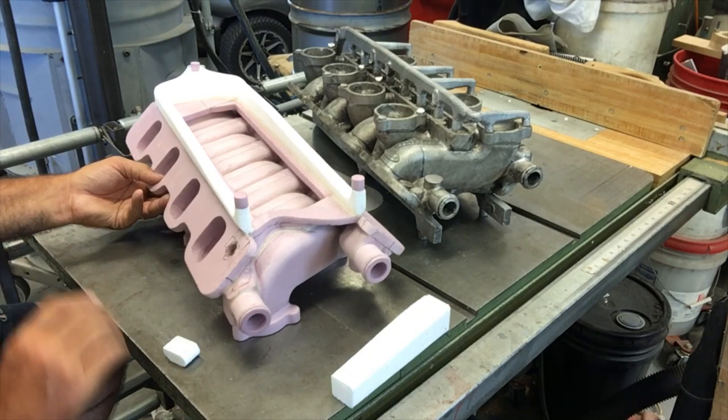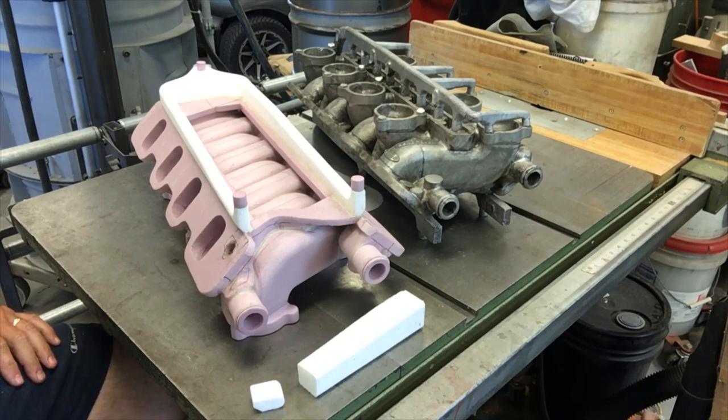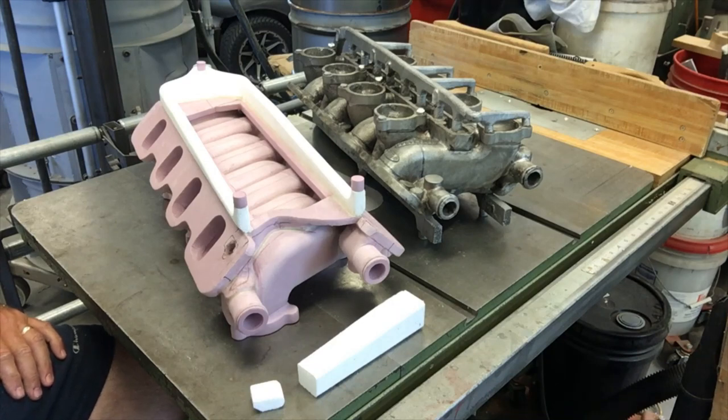And then I'll come back here with you, and when I pack it, made some changes too. I've got brand new sand. It's fresh sand. I noticed that my old sand, when I was sifting it, has probably become contaminated, but it just didn't flow and move under vibration as easily as fresh new sand did. So we're going to have new mold media. My old media was 5 years old, so it didn't owe me anything. So 35, 40 bucks later, I've got 500 pounds of fresh new sand, and a new position in the mold, and a slightly different packing method, which I'll elaborate on in the next segment here, and I'll join you with that shortly. Thanks a lot.